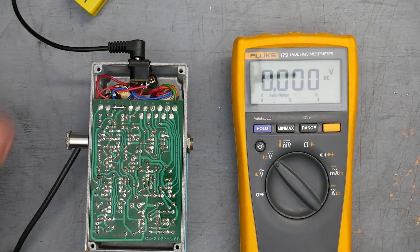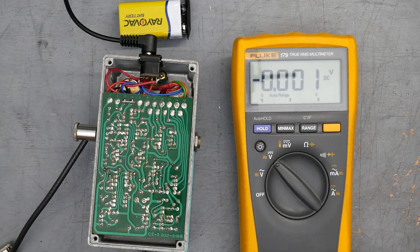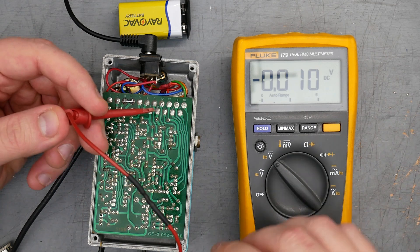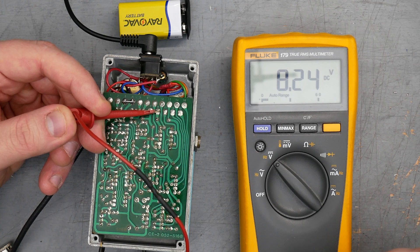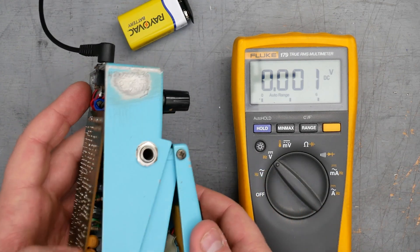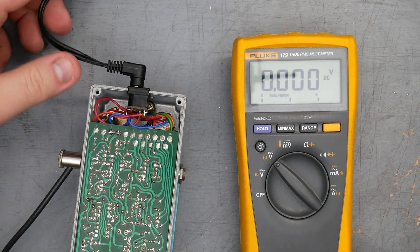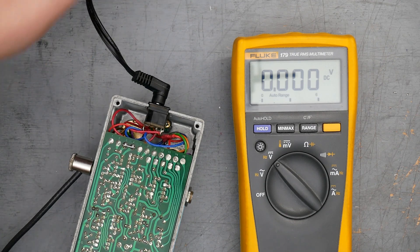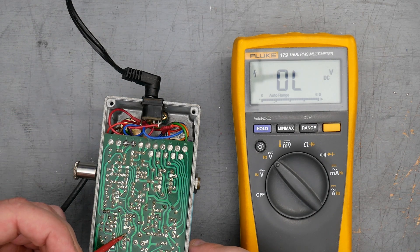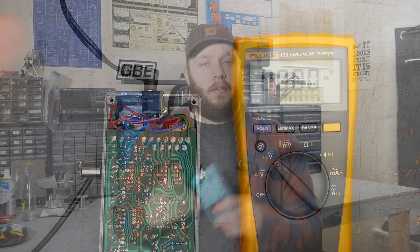So now I've got the jumper installed and I've got a 9-volt adapter connected to the DC jack - there is no 9-volt battery in the pedal. Theoretically if that mod worked, we should now read approximately 8.3 volts on pin 9 instead of the 5.5 we were getting before. Yeah, there you go - approximately 8.5 volts. If we turn the pedal over, we should see the light come on - and we do, there you go. It'll also work with 9-volt adapters. This is just one of the True Tone One Spot single 9-volt power supplies hooked into my bench. This is going to be even higher voltage because it's a regulated power supply - 9.43 volts all the way up here to the clock, 9.3 volts. It is now modified to operate on standard 9-volt adapters.